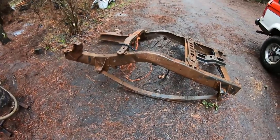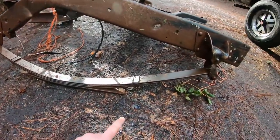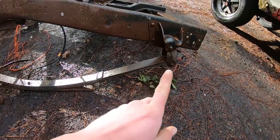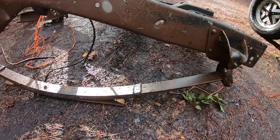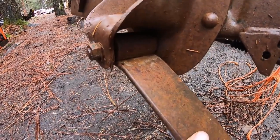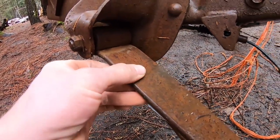Here's a chunk of truck frame left over from a previous project — my homemade tank. This is the spring. If you're not familiar with the way leaf springs work, it's just a pack of flat pieces of spring steel that are layered from smallest to largest. The one we'll be using is the longest one, mounted to the knuckles. This uppermost spring has a connection point from the spring pack to the frame — before these springs were tempered, they were rolled into a circle, so we won't have to do any welding to mount it onto our hinge at the top, because welding could very easily ruin the spring temper on the steel.